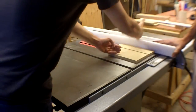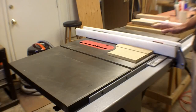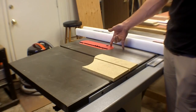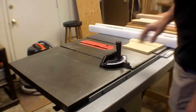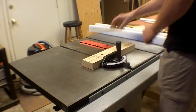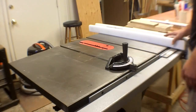As a rule of thumb for fence distance versus work piece width: you can cut squares. But as soon as the ratio of width to length is less than or equal — meaning the piece is wider than it is long — you should be using a miter gauge. You can also screw a sacrificial piece of wood to the miter gauge fence, run your work piece on that, and even run the miter gauge support fence right through the blade — that's by design.